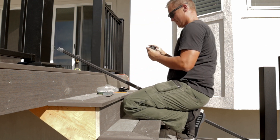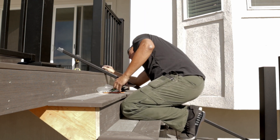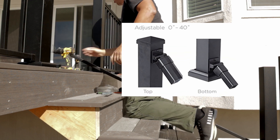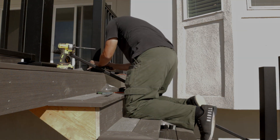Moving to the stairs, they are performed in the same manner. You just build the railing and rack it to one direction and the railing will drop to the necessary angle. If you choose to go with AFCO, I highly recommend you use the pivot brackets for your stair railing. The template mentioned earlier has the identified holes to make installing these just as easy as the others.